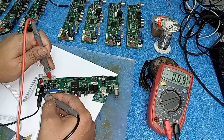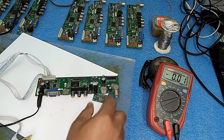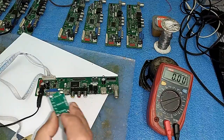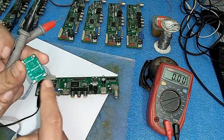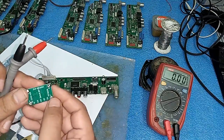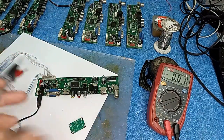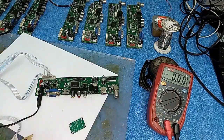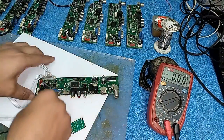So it is obvious that the 6-pin regulator IC is not working. Now we will modify it and use a step-down buck converter. We will give it 12 volt at the input and take 5 volt output, and connect the wires to this coil.